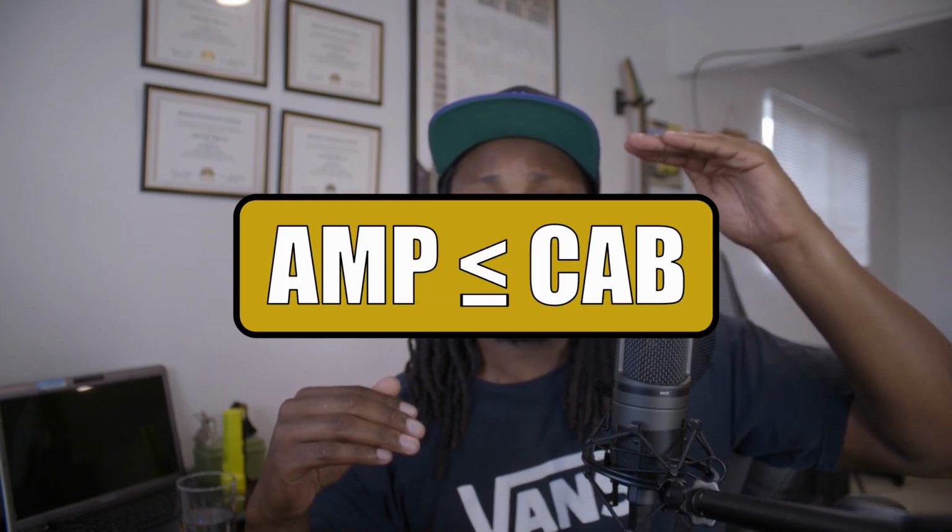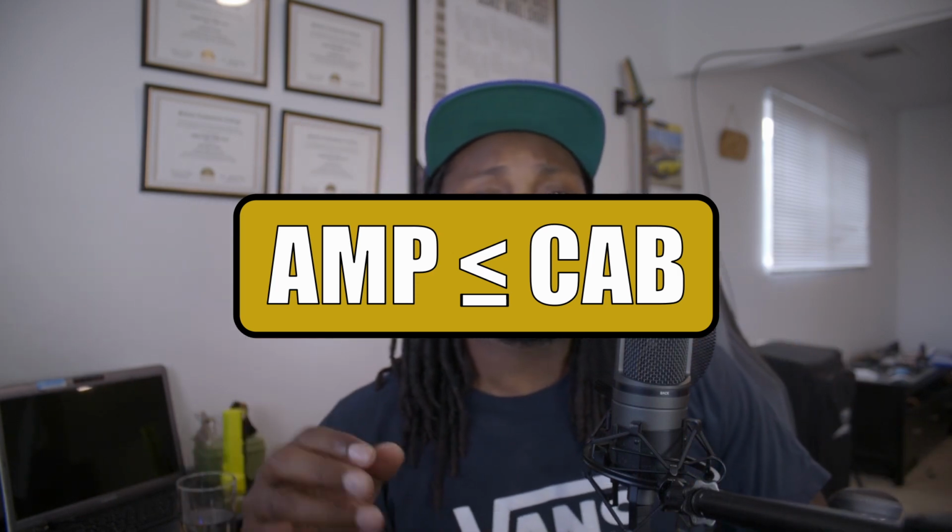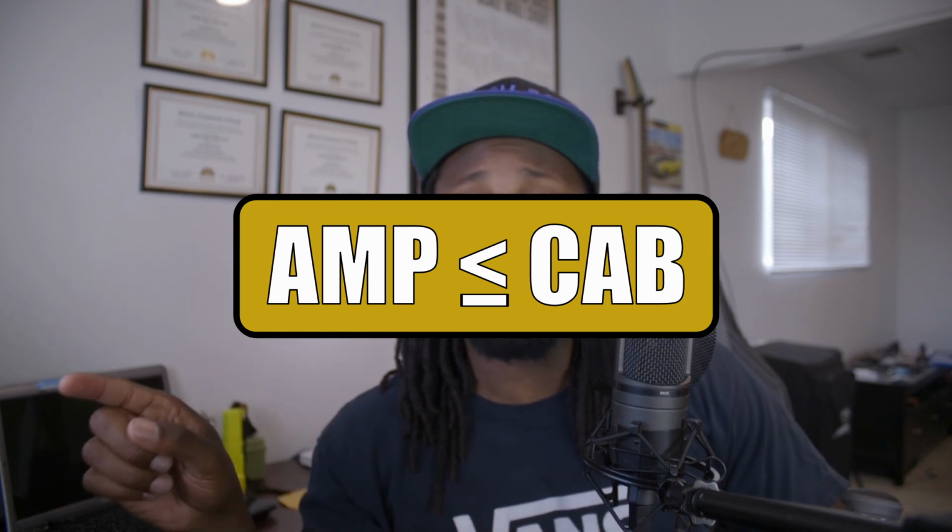You always want your amplifier to be less than your cabinet, as long as you're counting up in your signal chain. So amp 4, cabinet 8. That's how it goes. Anyways, like I said, this is the speaker cabinet that I use in tandem with my Gallien Krueger MB200 for my practice rig. As I stated before, it's a 400 watt, 8 ohm, 210 cabinet speaker.